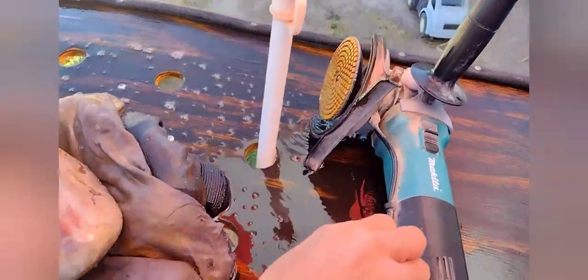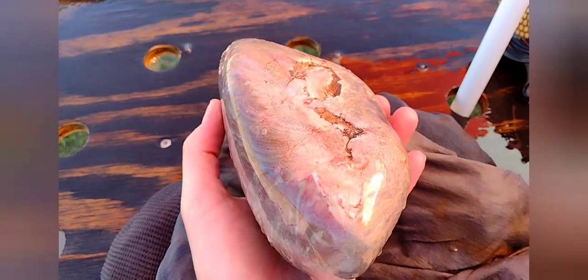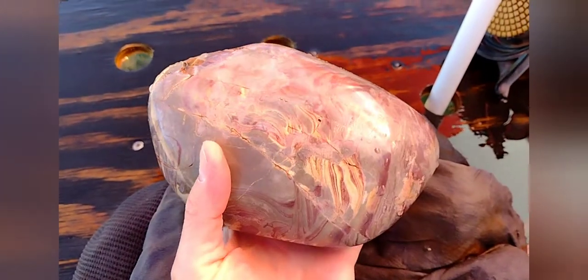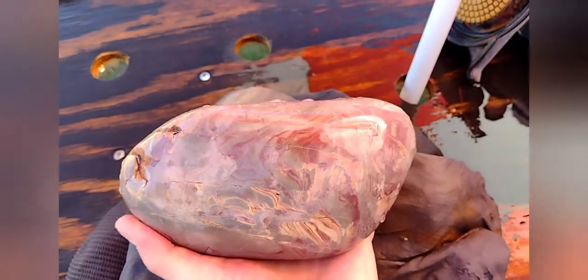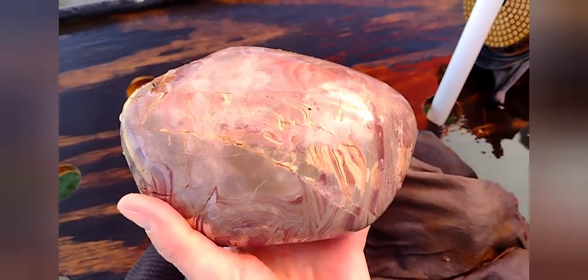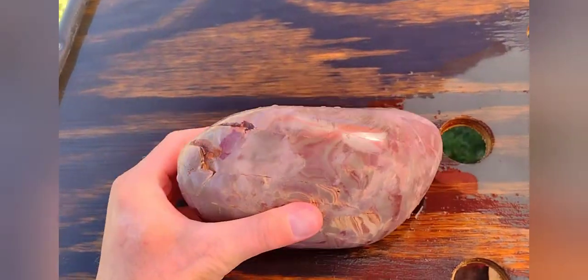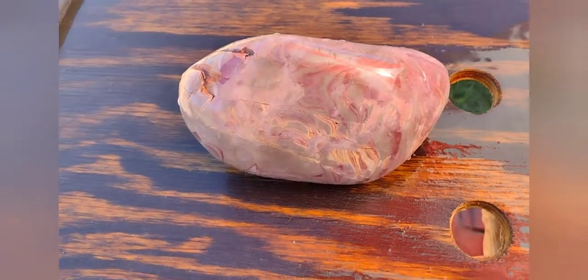Finally done — that's nine steps! We had the steel grinding disc, and then steps 50 through 6000: the 50, 100, 200, 400, 800, 1500, 3000, and the 6000 grit. Let's get this piece dried off and see just how shiny she is now.